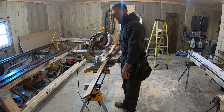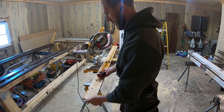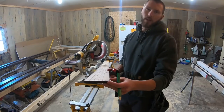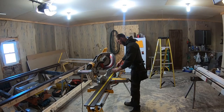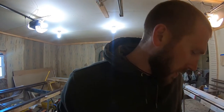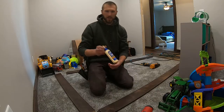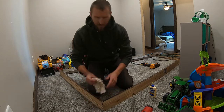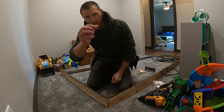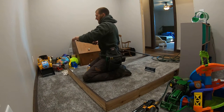Here's my jamb — I had 81-1/4". Pulling off the very top edge and making my mark. I'm pulling off the top and taking an extra 8, then 50-5/8". I'll put the jamb together — shoot it with my 15-gauge nailer, glue it, and also run some cabinet screws in the end. I'm using Titebond 2, pinning it with my 15-gauge nailer, and using GRK screws.